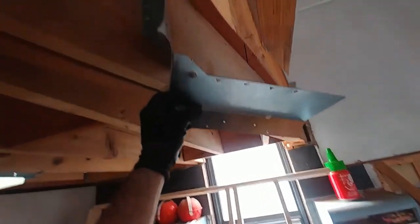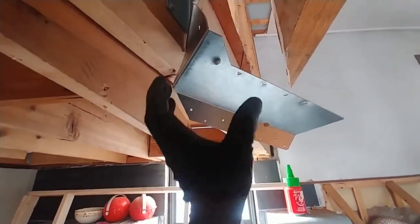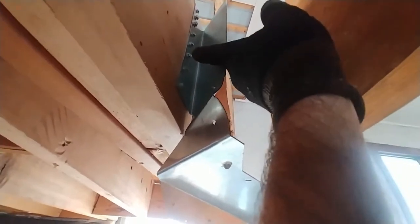and then shot that all together from both sides, which is good. Now, finally, our big, heavy LVL acute angle hangers came, and we've been working around the LVL in its final position this whole time. So the question became, you can slide those up from beneath. The angle still needs to be tweaked, but the angle that you get with it, which is this here, is as acute as it gets, I think, before you can't drive these screws in the small side.